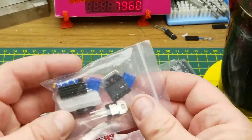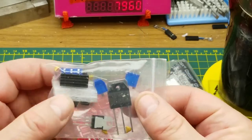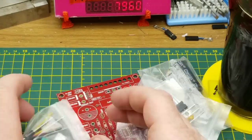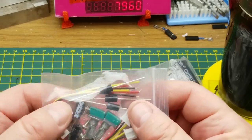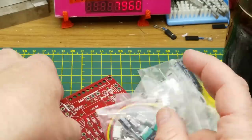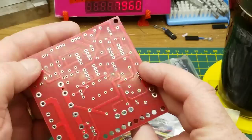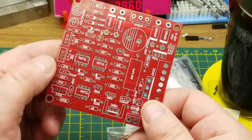There's a bunch of resistors, and even bigger — a couple of fairly big power devices, a heat sink, three chips, a couple of pots, some smaller caps, and some beefy rectifier-type diodes. There are four of them, so it's got a bridge rectifier. It is a power supply of some description. Look at those chunky tracks — cool.